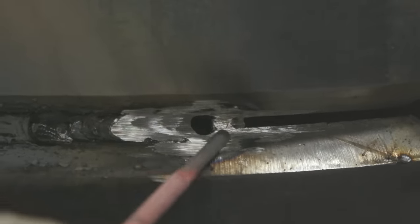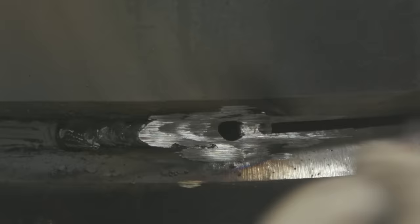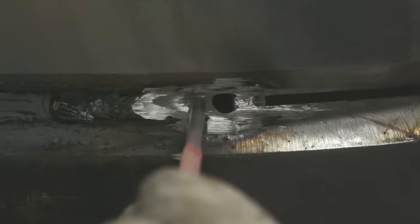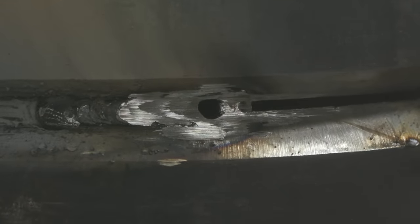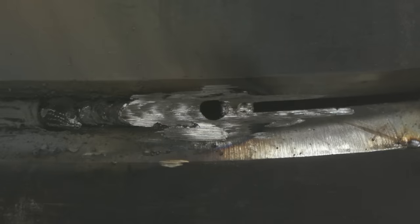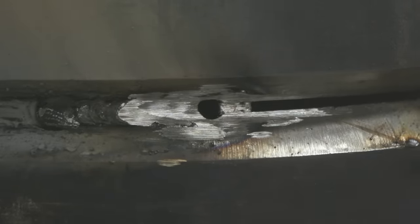You're gonna want to open up a keyhole similar to this as you're coming this way. Say I was coming from this way on and to tie into here, I'd start opening up a keyhole and I want to start walking that keyhole until I start hitting thicker material, so that transition is pretty smooth from the inside. Yeah. Okay. From the inside. Thank you. You're welcome. So you wanna? Yeah, I want to see how would you do this.